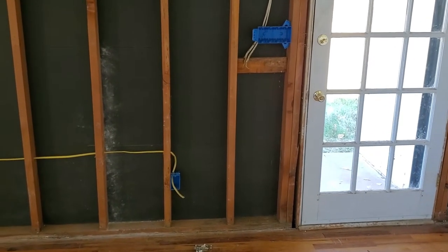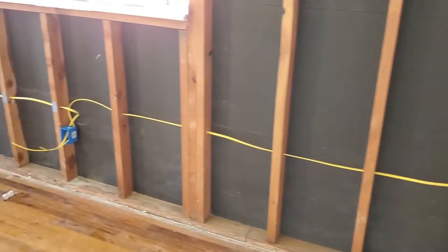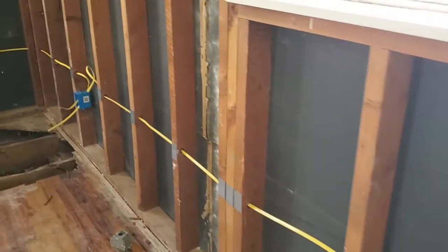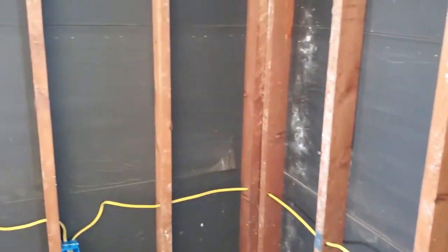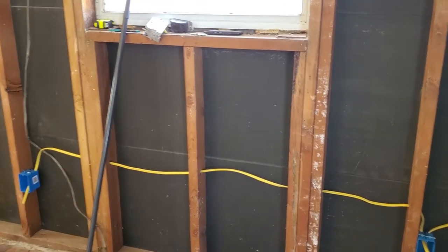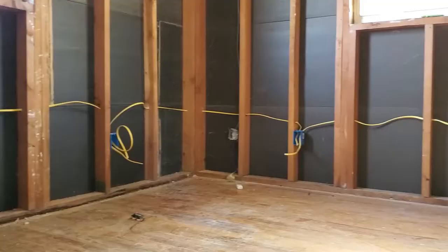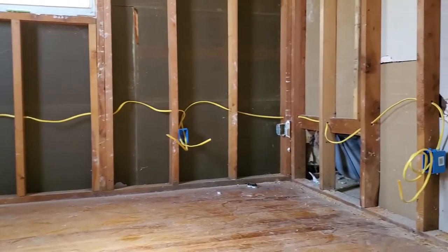I want to show you guys a little bit of what I did off-camera. We got some of these blue switch and receptacle boxes and installed them in each of the rooms. We ended up installing each receptacle box at 12 inches above the finished floor and pulled about 6 inches of extra wire into each box to allow us to easily hook up the new receptacles. Those silver plates on the front of the 2x4s are stud guards — we put them there to prevent screws and nails from puncturing the wire since it's so close to the front of the 2x4.